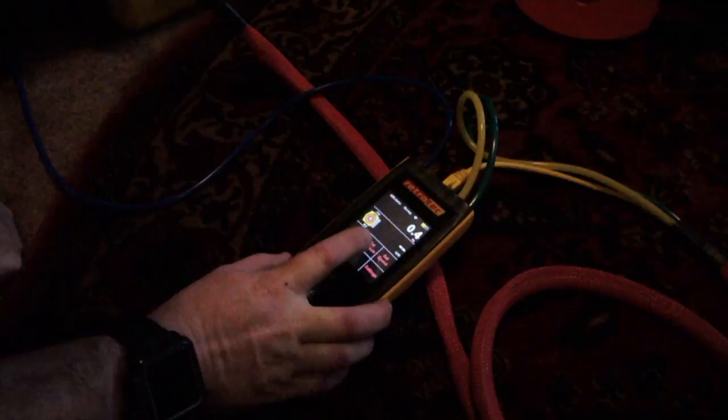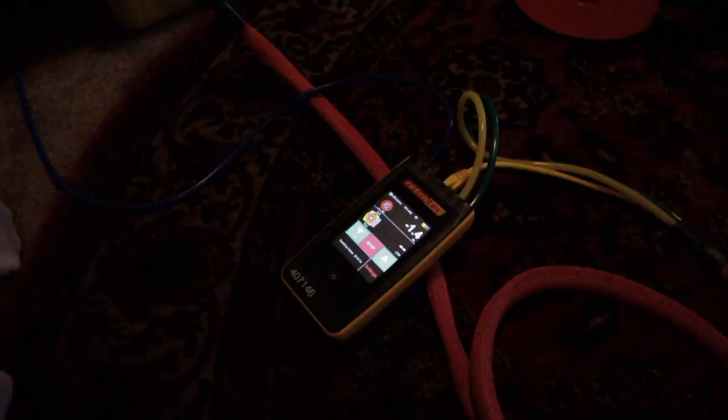Set up on the third floor split heat pump, and we're doing a duct test. So we're going to set it to 25 and run the test as a total leakage. Once we get total leakage, we're going to run the blower door at 25 and set the manometer for the duct tester to zero, and that will give us duct leakage to outside.